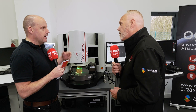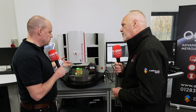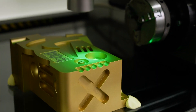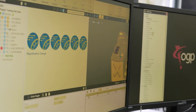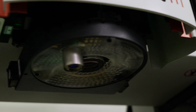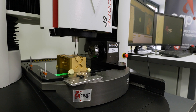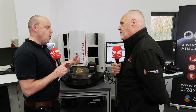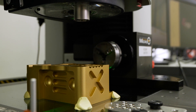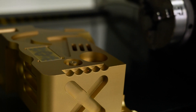The optics on this is what really gets my interest. Why are we using optics compared to touch probing — what's the benefit? If you imagine a traditional camera system with some form of focus, and you introduce scales to that camera, you've got the ability to do Z measurement. Along with a good structure, it gives you very accurate measurement in the Z axis for depth measurement by using optics. Now, depth measurement is one thing, but the advantage — you could do that with a probe as well — is it because you don't necessarily want to touch the part? Well, there is that, because some manufacturers may have a chrome component that you can't actually touch because you may mark the component. So optics or laser may do the application.